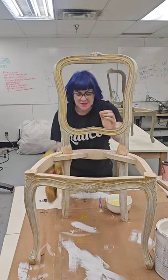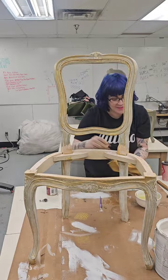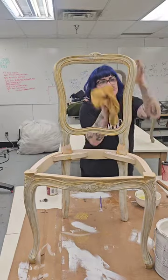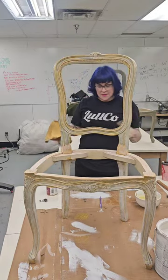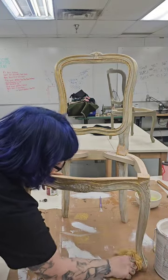So it's kind of like you're sanding it now with the cloth, like washing. It's still just damp, it's not soaking wet. I want to wash the paint off. And this is a testament to how good it's going to stay, in these areas where it stays built up. It's going to cure like that. That's why I like the acrylic enamel finish, because it hardens really well.